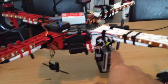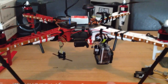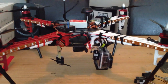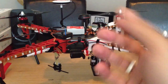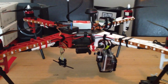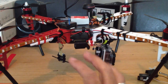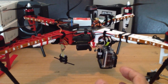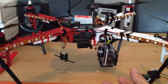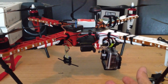In terms of camera, I like the way this is at the minute because it's light relatively speaking. I did look into using some gimbals for stabilising the GoPro for video. If you take your time, balance the motors, balance the props, get everything vibration-free, and spend some time flying the quad — I have the gains on a remote knob so I can tune it to the weather conditions — this is a fairly stable quad. The video results have been good, and in one of my other videos you can see with this camera hard-fixed, I'm getting good results.